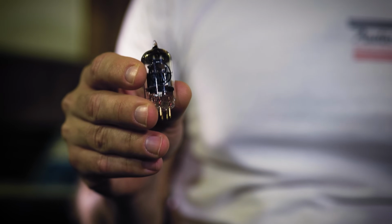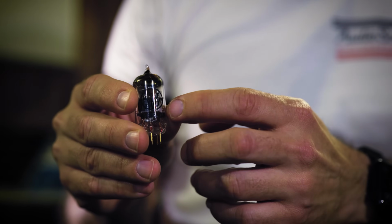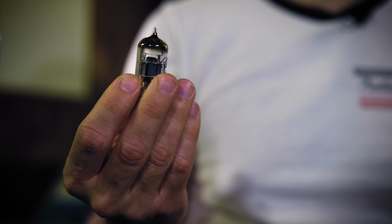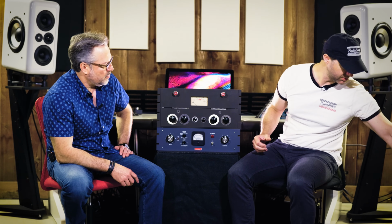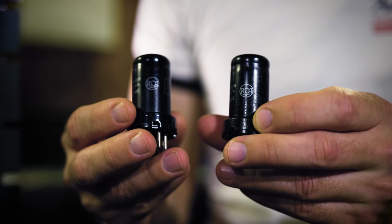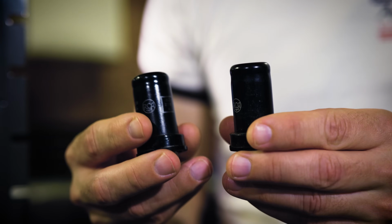And yes, so basically two perfectly balanced triodes here is what's creating that compression effect. As you start turning up that gain, this is what it's hitting, creating that compression. On this, conversely, like I said, it's an earlier one. They were using two of these remote cutoff pentode tubes, 6SK7s, which are, most of the ones we use are actually from the mid 1940s.